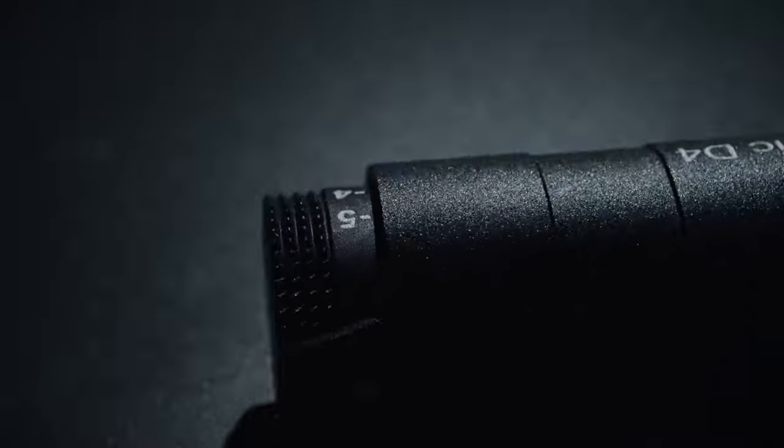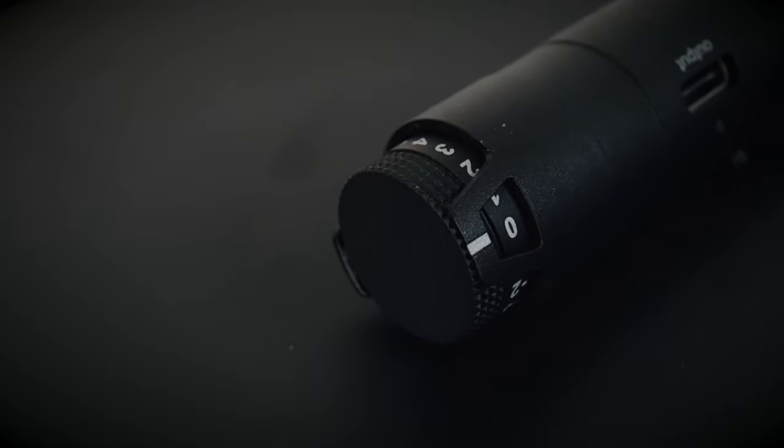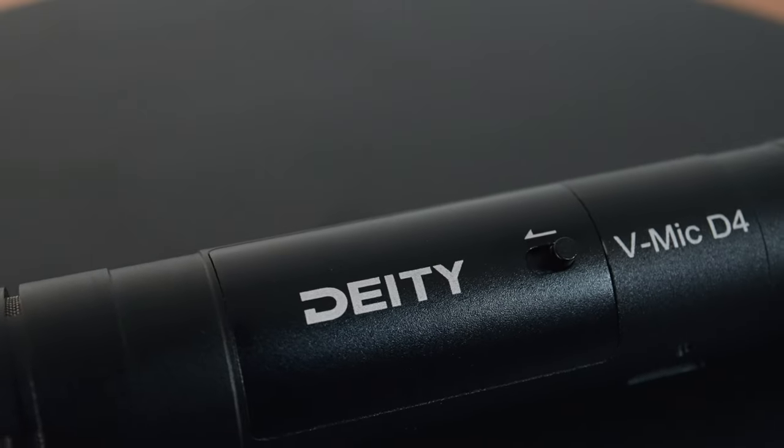The D4 is pretty connectable - obviously to your camera, but also to smartphones, laptops, and tablets using their smart port cable, which looks a lot like USB-C. A really nice thing is a stepless gain knob with a range of minus 5 dB to plus 10 dB, so effectively it's a pad and a boost in one dial. One thing I noticed is the D4 doesn't have a low cut filter for cutting out super low frequencies. It starts recording bass frequencies around 50 Hz, so maybe the omission was intentional from Deity.